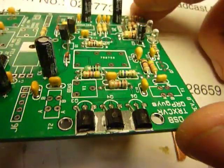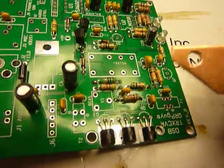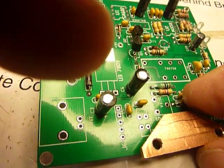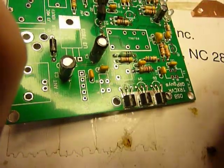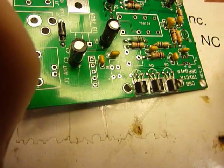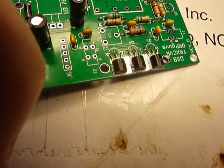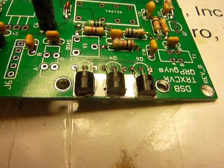I have the three transistors in here now, folded back just a little bit, with a dot of white heatsink compound under each one. I dug around in the junk and was very happy to find this — it's a piece of 50-thousandths thick copper, already that length, and I marked the holes so I can bolt it over the top. I'm going to bolt it with 4-40 screws, half-inch long, and put two split ring lock washers under each nut, with the nuts on top and the bolt heads coming up from the bottom under the circuit board, two on each side.